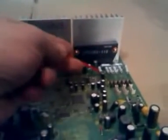Now, in the event where I've checked my convergence resistors — let me rotate this forward a little bit — you want to isolate each resistor from the rest of the circuit so you don't get what's called a distributive resistance reading, which can be very inaccurate and misleading. Measure each resistor with an ohmmeter. In this case, this resistor is 120 ohms, written right on the resistor, so I expect to get 120 ohms plus or minus 1%. Make sure you check those, because you don't want to order your amplifiers and come to find out later the color blue won't converge because you forgot to check one resistor tied in with blue.